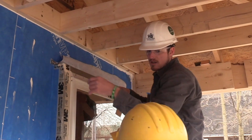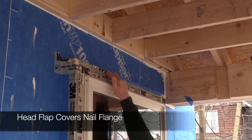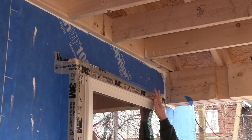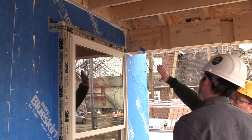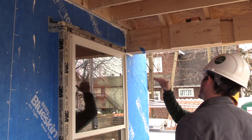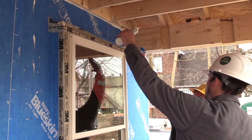I have you coming out onto the wall. We are going to have to put something over top of this because you need two inches of seal for it to stick. I would stop it on the wall so you don't have a flat area for ponding for water to come in — it's not going to happen here for general building purposes, but roll it up the wall a little bit.